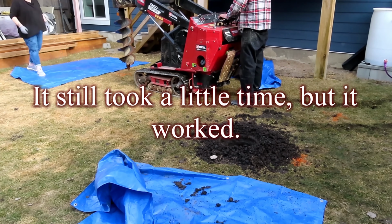Apply decking and waterproof the deck. First, you need to bend some flat stock aluminum sheets to put between the floor joists of the deck. Bend it so that it hangs down more on the outside to give it a slope. I'm bending it to hang 1 inch, or 2.5 centimeters, at the top, and 2 inches, or 5 centimeters, at the bottom.